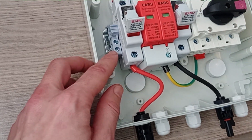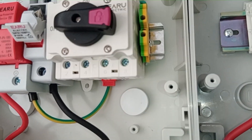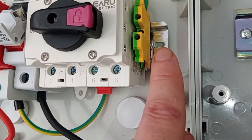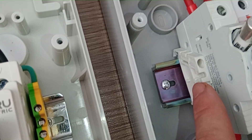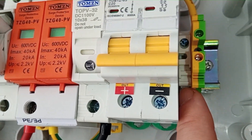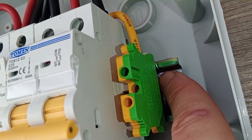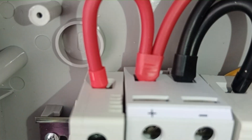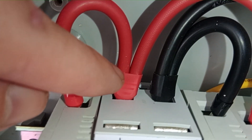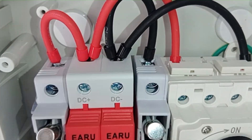Another difference: on the cheaper brand there is only one clamp that blocks lateral movement of the components on the DIN rail on one side, but there's no corresponding clamp on the right side. They may have assumed the earth ground connection to the DIN rail handles that, but it doesn't. What Thompson did is add one clamp on each side plus the ground connection — those tiny things make a difference.